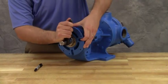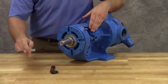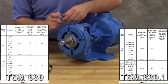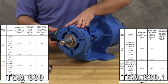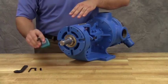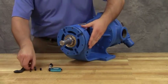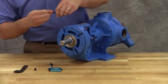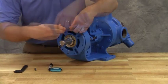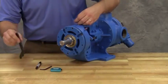Back off the bearing housing counterclockwise until the rotor shaft can be turned with a slight noticeable drag — this point is known as zero end clearance. Mark the position of the bearing housing with respect to the bracket. Using the measurement from the table in the technical service manual, make a second mark on the bracket left of the first mark at the distance indicated. In this example, we require five thousandths of an inch end clearance on a model KK124A pump, so the mark is made one and a half inches away. Rotate the thrust bearing assembly counterclockwise until the bearing housing mark aligns with this new bracket mark. Tighten the two self-locking set screws in the outboard face of the bearing housing with equal force against the bracket. The pump end clearance is now set and locked.